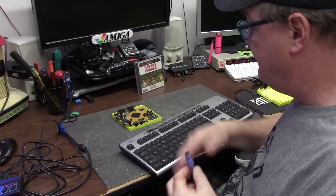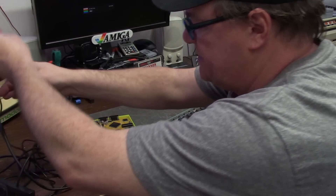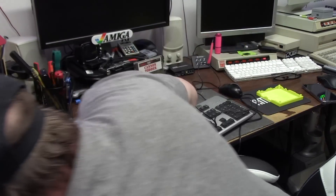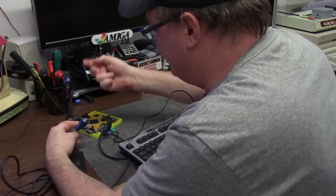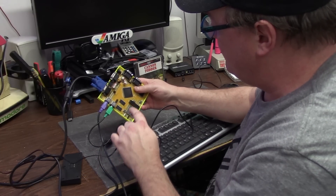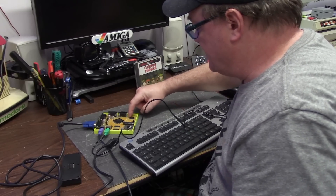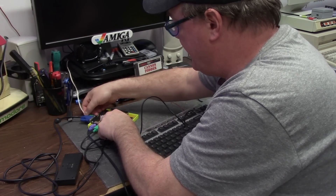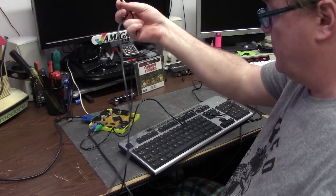For demonstration purposes, I'm going to leave the lid off. It's clearly marked, so we're going to hook up a PS2 keyboard and a PS2 mouse. It comes with an included mini 5-volt power supply, which we're just going to run off my solar — green earth and all. I'm going to plug in the VGA connector. You can also hook this up to a 15 kHz monitor. There's a jumper on board for 15 or 31 kHz, and also a jumper for MCU or FPGA chipset. Here's the 68000 right here in the front of the board. We're going to take the 3.5mm from the Dell 2410 and plug it directly into the device, and plug in the controller.